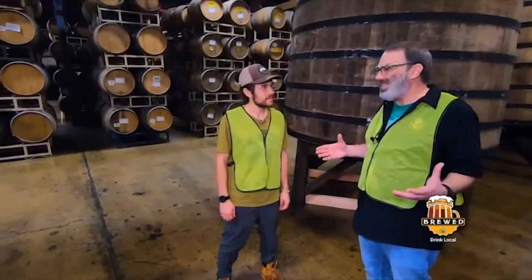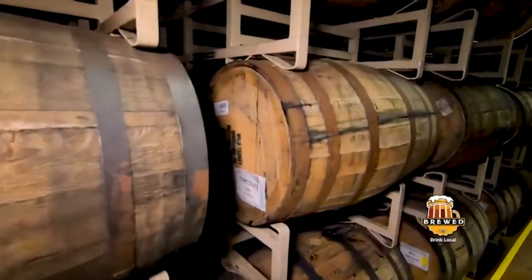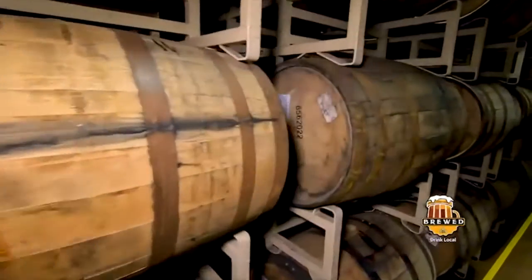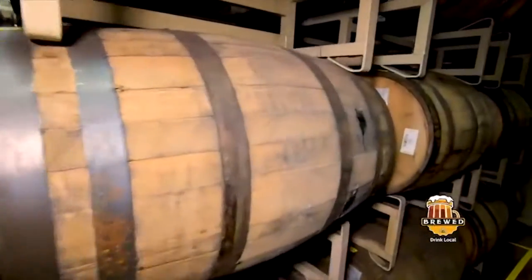When you've got all of this going on, you've got this many barrels, you've got so many microbes, you've got different places that you get your barrels from. How do you make a beer consistently good? Sanitation is absolutely key. Having very strict parameters on when you're sampling the barrel, using a lot of ethanol to spray everything that's touched beer. We use ozone as well to ozonate the barrels. If we're cleaning them, we're rinsing them. Again, sanitation is the biggest concern.